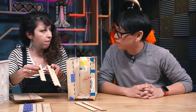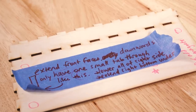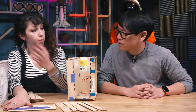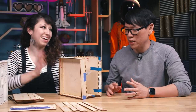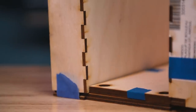My process was to cut a piece, and then as it would come out of the laser cutter, I would figure out — okay, these two tabs are off by an eighth of an inch, or this needs to move. As the pieces would come out, I would fit them together, test fit, and take notes, giving myself pretty extensive design guidelines on how to do it better. Then I'd go back to the computer and make my edits. It's really a brute force process because it's not automated — if you change the length of one piece, it doesn't automatically adjust the size of the tabs on another piece.